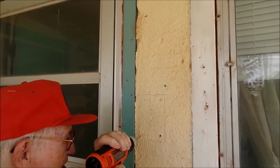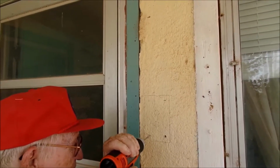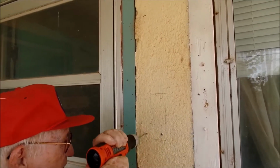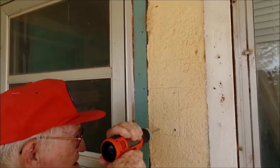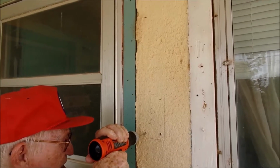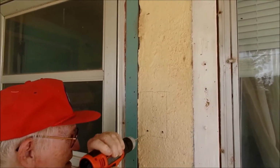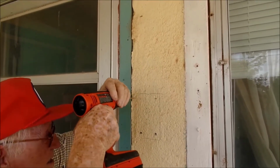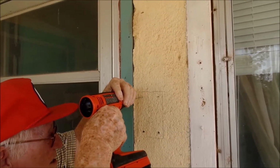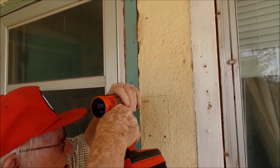When you're cutting through masonry, if you were to go straight at it, you could crack your masonry, plus you could go off track, because it won't stay in place when you're going across a hard surface like this. And unlike wood, you don't get a little pilot hole knocked into it with an awl. You actually have to do this yourself or face cracking your entire wall.